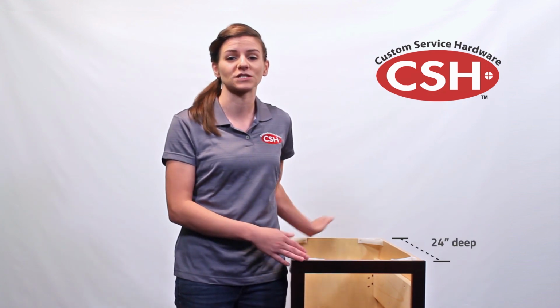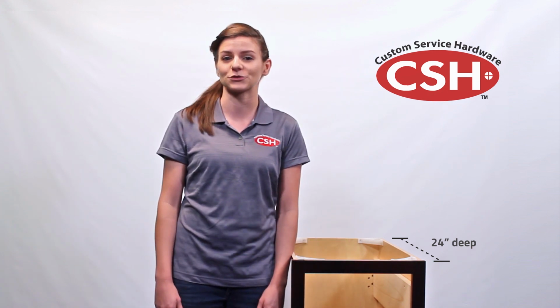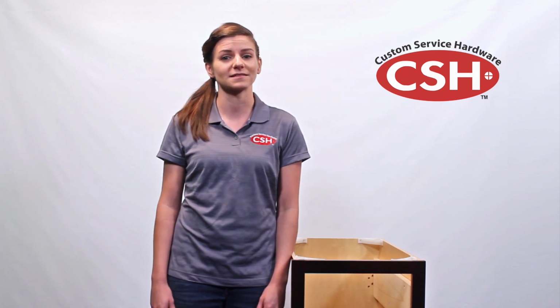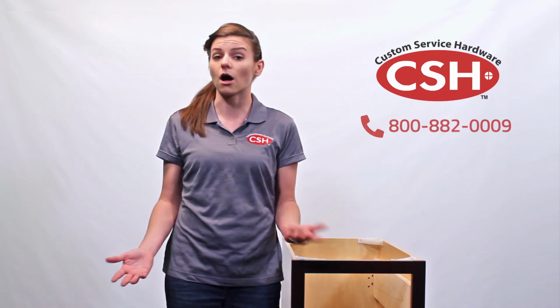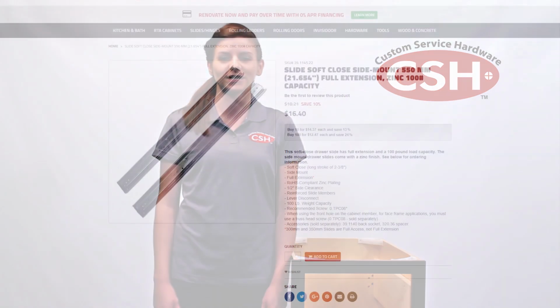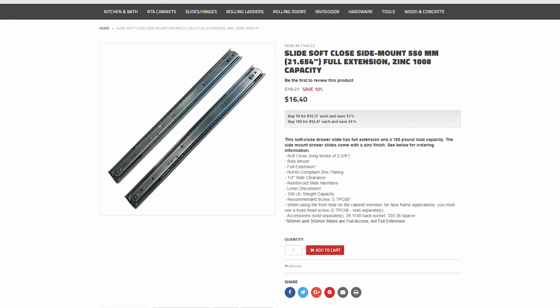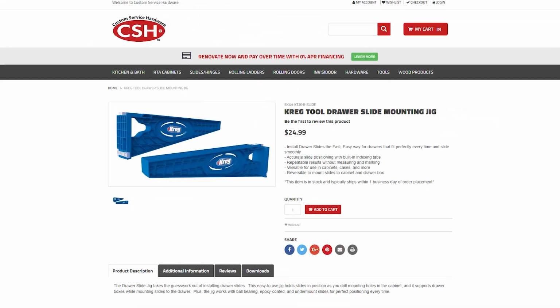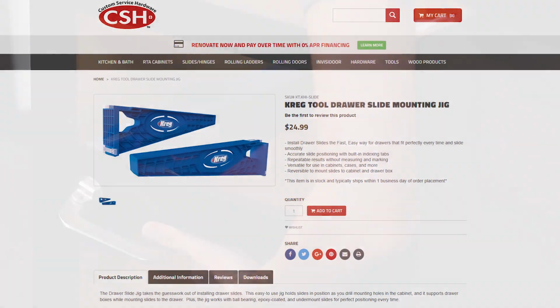This is a standard 24-inch depth cabinet, so we'll be using a standard 22-inch size slide. Now, if your cabinet is a different size, please call us at the number in the description for more information. Also, because the drawer box we're using was built for a side mount slide, we'll be using the 39.1145.22 slide from cshardware.com.